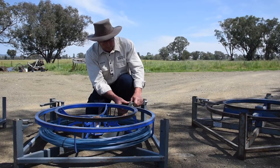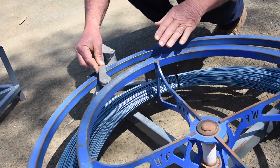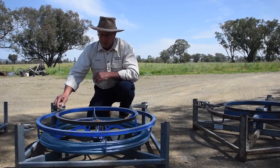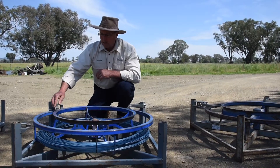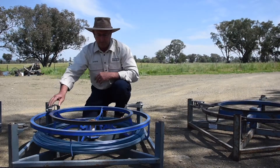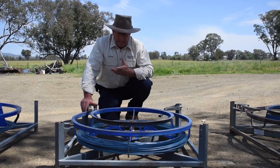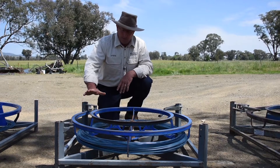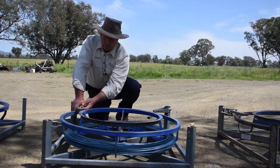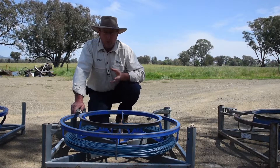The pickup arm is very similar but we've lifted it slightly. The brake is slightly different — laser cut pieces all put together, whereas before it was more fabrication and bending. But the process is the same: it works the same, it's on bearings, you pull the wire to release the brake, it spins out, and it's been working really well. We did, however, have issues we weren't able to resolve — if the coil did tangle, it'd tangle around the pickup arm or brake arm and invariably pull the rollers off or you'd end up with a bird's nest.